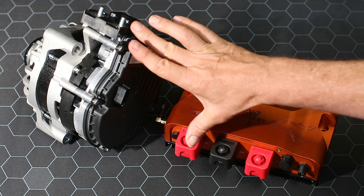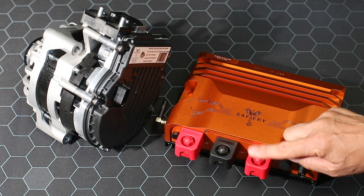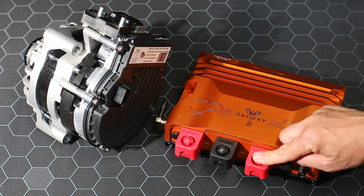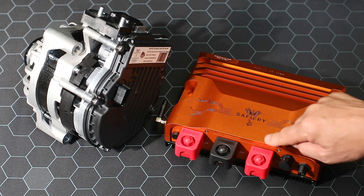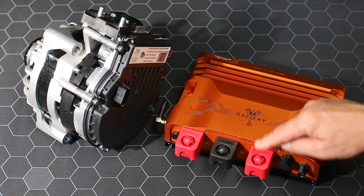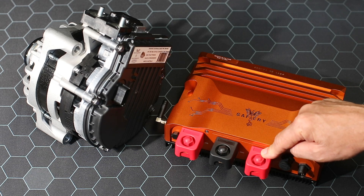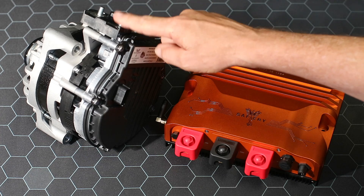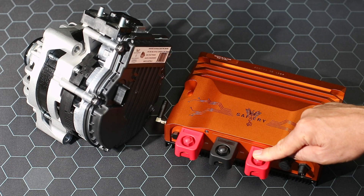Another combination is to join the 48 volts up and have just 12 volts coming out of this side, totally independent to the starter motor and the starting battery. This will give 12 volts without any battery attached. Internally, we have a pre-charge mode that charges the low side and allows it to continue to run without a 12-volt battery connected. If it's a 24-to-48-volt unit, then you've got 24 volts pouring out of here as well as 48, so you can have different voltages simultaneously.